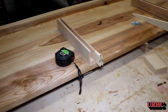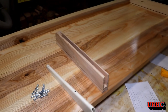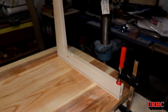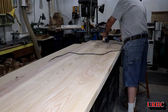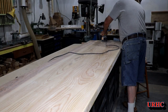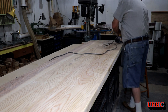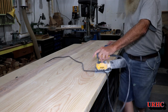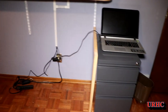There's the first bracket that goes against the wall, and there are the two middle ones that hang off the shelf brackets. This one here actually hangs off the shelf bracket but also has a leveling leg on it so you can sit on it and not worry. Now I'm doing a final 320 sanding on the top — actually 320 then 1000 grit — and I went back and put a couple coats of Johnson's Paste Wax on it.